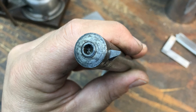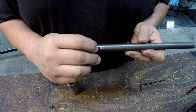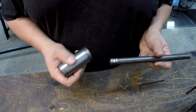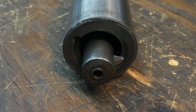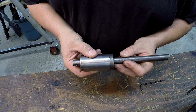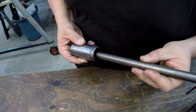We've got the tool bit mounted in the bar and I think we're going to have good clearance in there to be able to pass through. I like to make sure the tool bit is not sticking out past the other side in tight-tolerance situations, so that when you retract the bar to make your next pass you don't accidentally scratch your machined area. I've got it just enough where you can retract the tool and feel the bar touch the material if you go a little too far.